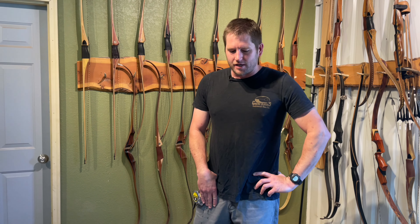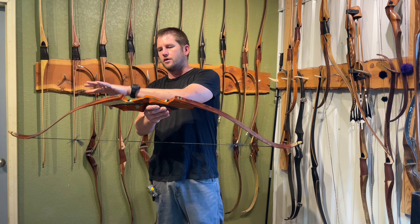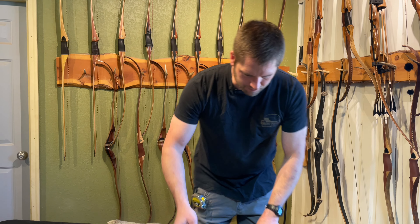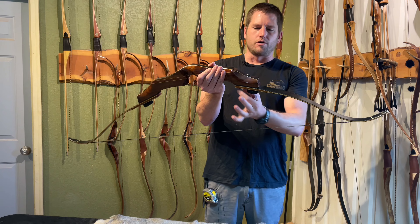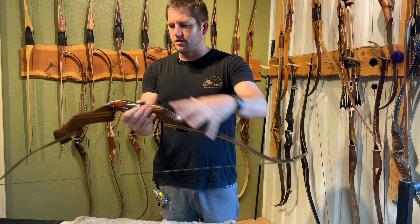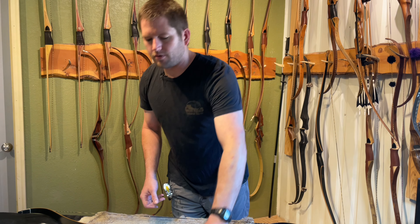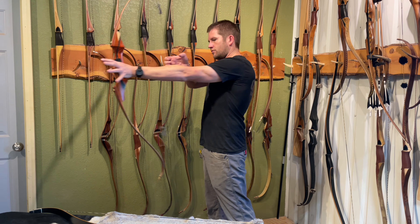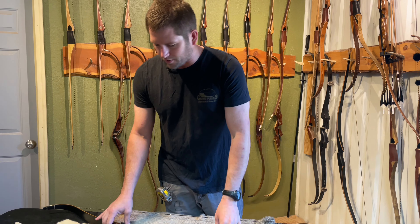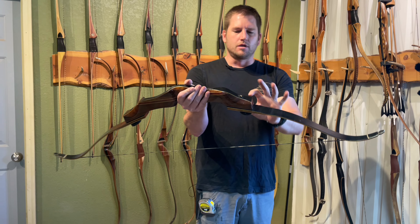I personally like back-mounted limbs because I feel like they flow through the bow so much prettier and look so much better. On belly-mounted limbs, the problem is you have to have enough mass for your index pin and limb bolt, so you end up with this big bulbous knob on the back of your bow. This is considered the presentation side of your bow — the back is always the presentation side because that's what you're showing people when you're shooting. We always try to put the prettiest veneers on the presentation side. That big bulbous chunk of wood required to house the bolt and index pin is what I've always hated about belly-mounted recurves.